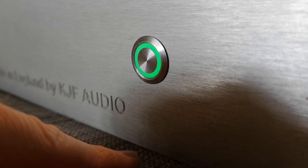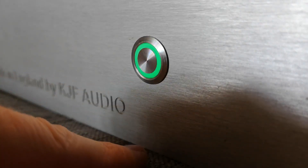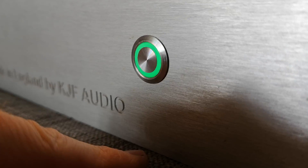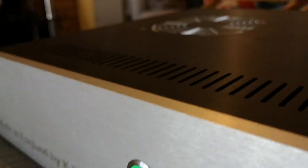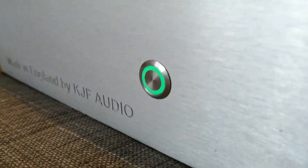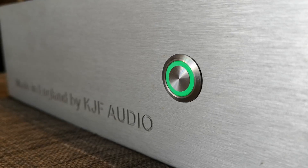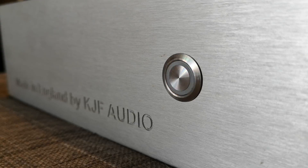So I've gone through the clipping mode. There are also a couple of error detections displayed here. Firstly, temperature — I've jury-rigged it slightly so I can tell the board the temperature's gone up and you can see what happens. The fans come on first when you reach quite a high temperature; they're very quiet fans and wouldn't come on until the amplifier was very hot, at which point you'd be at full blast. Continue to raise that temperature and you get an error: a double flash and a pause, double flash, pause — and that's just shut the amplifier down so it can cool down.